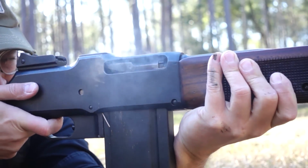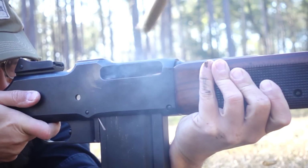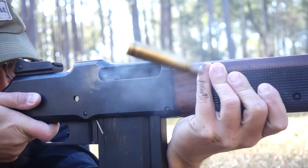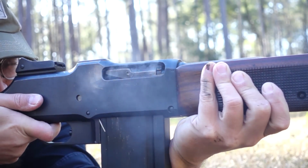I will. And I had thought they had run it. I didn't know because I wasn't at the range. I was in hot standby back at the shop. When you eject the cartridge, it comes out of a BAR so hard it rolls around and it slaps the side of the receiver on the way out, and it would have destroyed the finish on the outside of the gun. And all of the brass that came out of the BAR had a very nice dent in the top of it, right up at the neck, where it was whacking the side of the gun, and there was a big brass spot on it. I didn't catch that. I thought we had run a steel and everything.